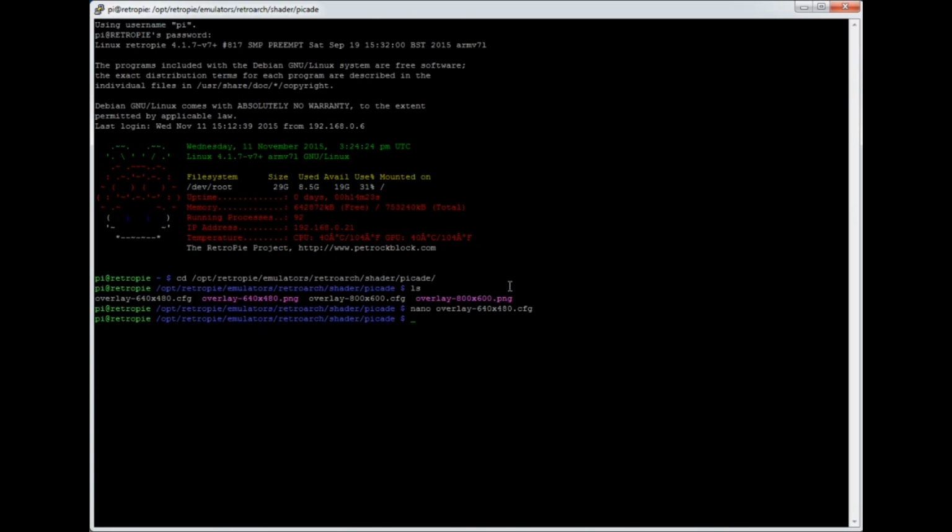Now, just briefly, I'll talk about the screen resolution. The screen's 800 by 600, but I think I'm only running it in 640 by 480, and you can check that by using this. Just go back to the home directory. There's a tvservice command, and if you put -m DMT, DMT effectively says show me monitor modes as opposed to TV modes, because you've got it hooked up to an LCD, so it's a monitor. And it says there it supports 640 by 480, but if you dig down and get a more detailed output, it will also say it supports 800 by 600.